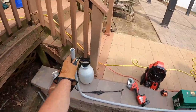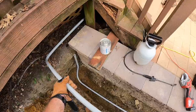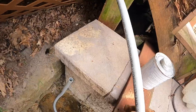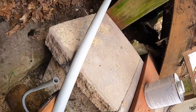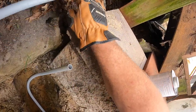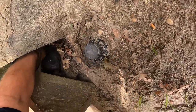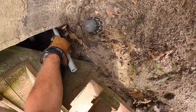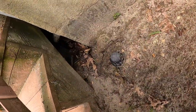What I'm trying to do here is get behind that staircase so I can come up the other side and attach the rest of the conduit run to get to the main breaker panel. Right in that spot is where the PVC pull box will be, to break up that more-than-360-degree bend run.